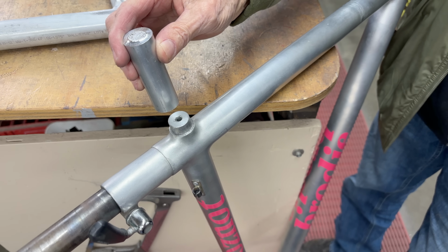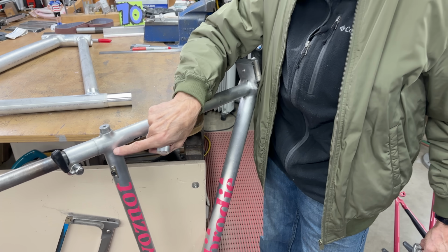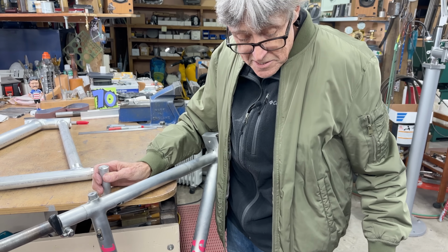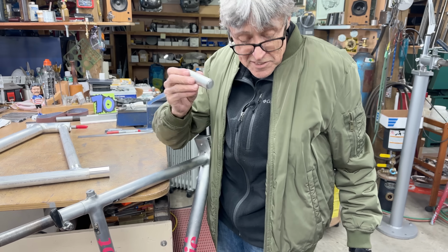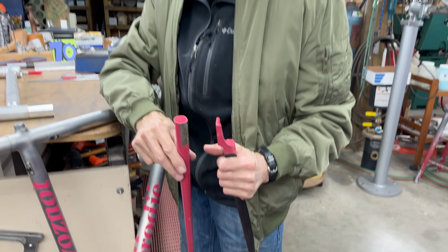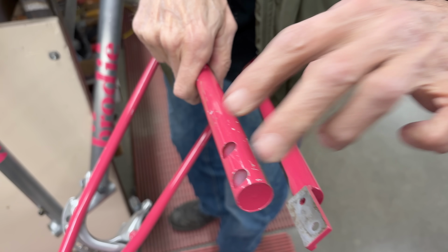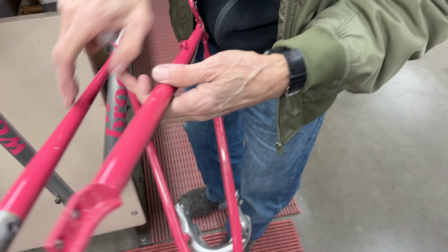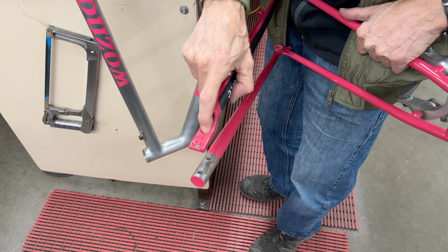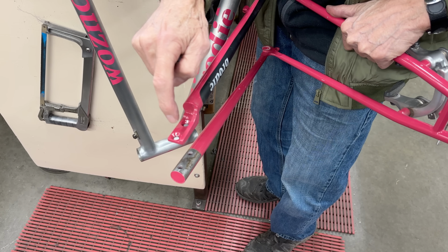We're going to go over to the mill. We're going to miter it 1 3/8. It's the same angle as the seat tube, and I mitered that at 6 degrees. The mill's still set. I just have to center it, and you can see how this works here. I put an alloy plug in there. It got drilled through for 8mm Allens. This is one. I was using Imperial back then, so these are actually 1/4 National Fine.